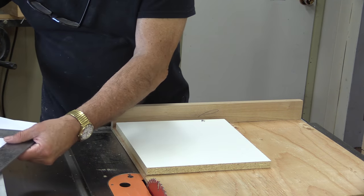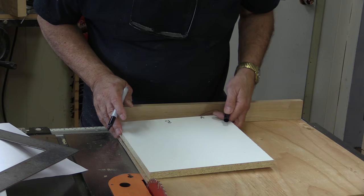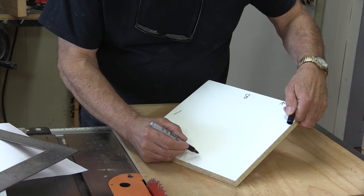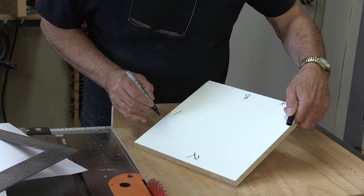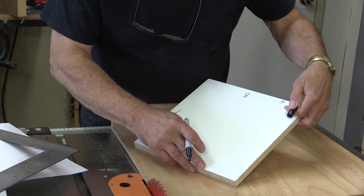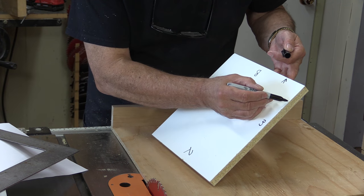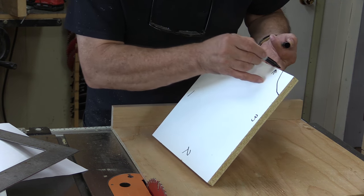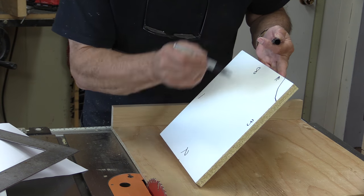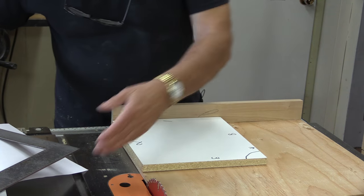Now the next thing I'm going to do is make a three cut. So I'm going to leave the base the way it is. There's a B down there. I'm going to make the first cut I've already made here. Now I'm going to turn this around and do a second cut on this side. So if this was off by a couple thousandths of an inch, and this one is also going to be off by another couple thousandths, so it could be four, and I'm going to make a third cut on this side, and then I'm going to put my square in this area here, because remember, this is the one that was on the jointer, so this is the last cut that I want to check, and if it's accurate, then this square is dead on. So I'm just going to go ahead and make the second and third cuts, and we'll check that and see how accurate that is.